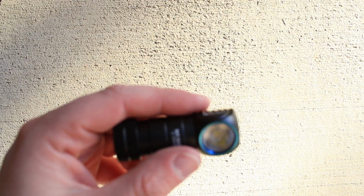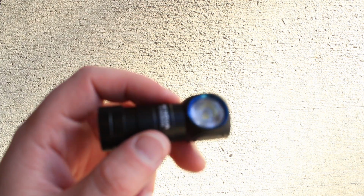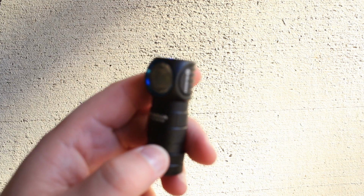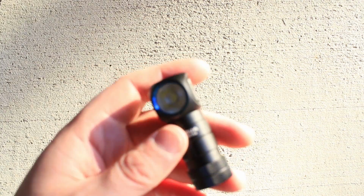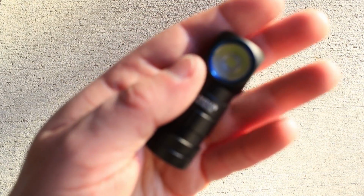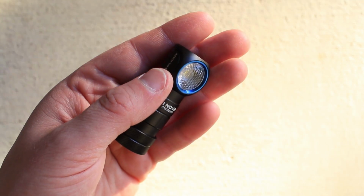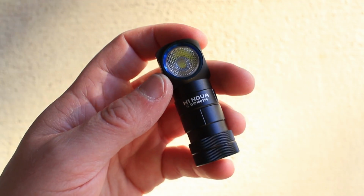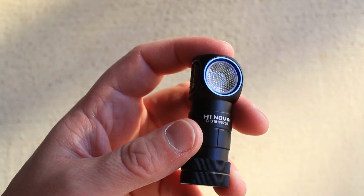It will run with a CR123 or an RCR123. I've been using both. The RCR123s I have are not the best quality, and the RCR123 technology just isn't as advanced as the CR123 technology. So your capacity in its current form is about half, and that's not the best. If you really want the most performance, you need to use the CR123s. They'll have a lot longer runtime.